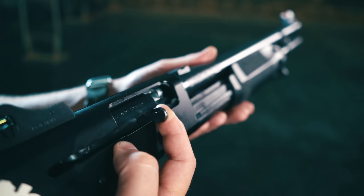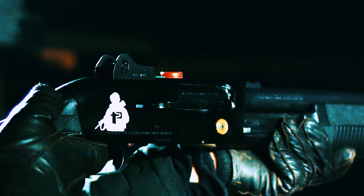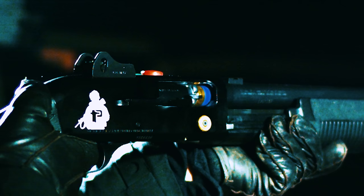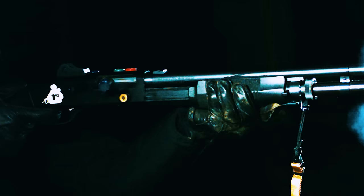You cannot even see it work here — I cannot compress it by hand. When you take the shot, the bolt carrier stays in the same place because of inertia, but the whole shotgun moves back a bit. That's when this spring compresses, and when the shotgun stops, the spring releases its power and actually pushes the bolt carrier back, which unlocks the bolt and completes the whole cycle operation.